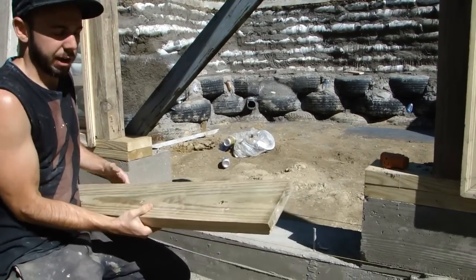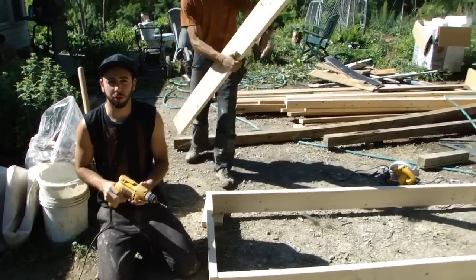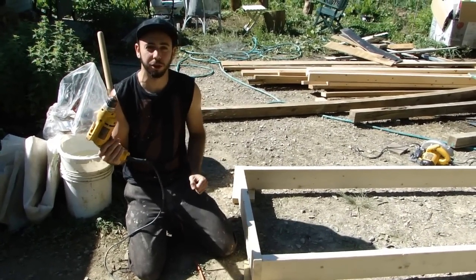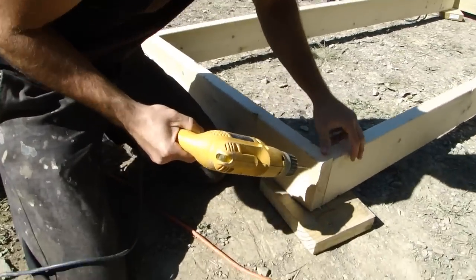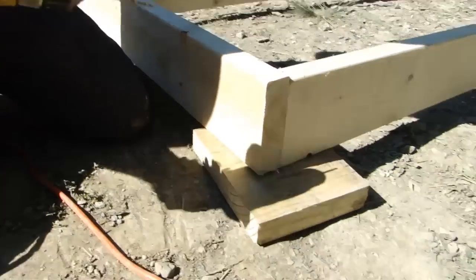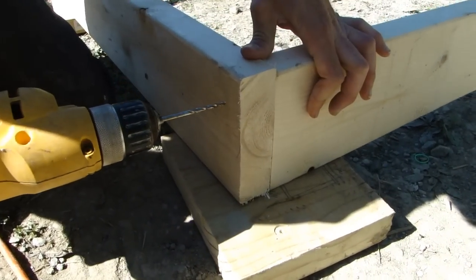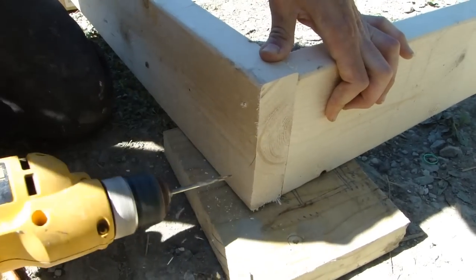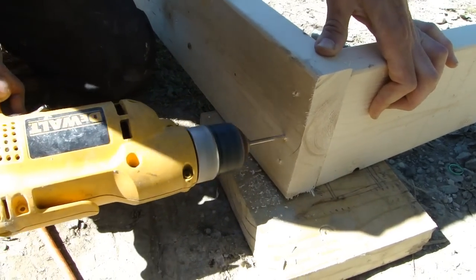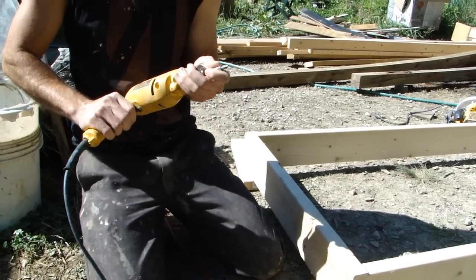This plate is ready to go and will be the bottom of our jamb. Now let's assemble the jamb. We start by drilling pilot holes for our screws so they go in nice and tight without cracking the wood. We're assembling the top to the sides of the jamb and getting it squared up. I like to put a piece of two-by under all the corners on level ground to keep the pieces upright. We're assembling this jamb with three-inch deck screws.